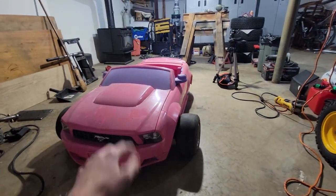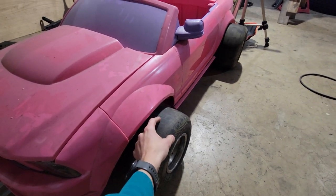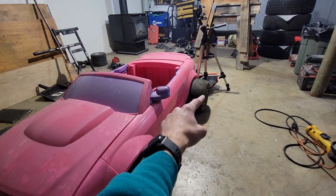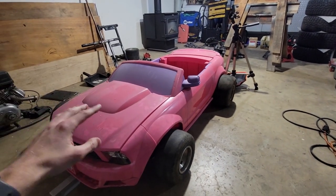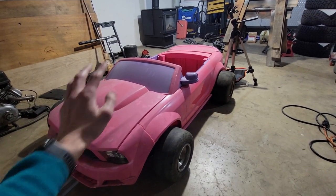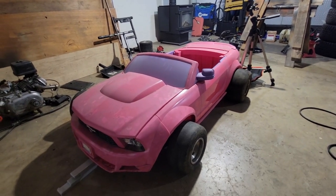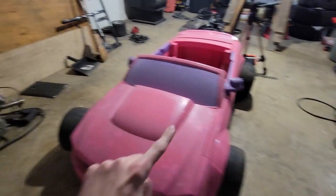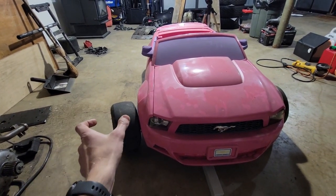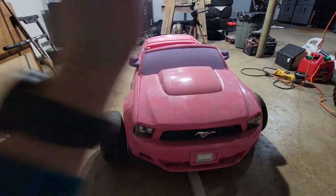It's going to make it a little more rolly but that's fine with me. I got three inches from the widest part of the fender to the outside of the front tire. In the back I got four inches from the widest part of the fender to the outside of the tire. I've got to keep in mind that the wider I keep these tires, the more room I have on the inside for the motor, engine, axle, seat - all that stuff, because that still has to go in there. So I'll take my measurement, and however much I need to take off to get this side to equal that side - the three inches - that's what I'm going to cut out of the center of that frame.